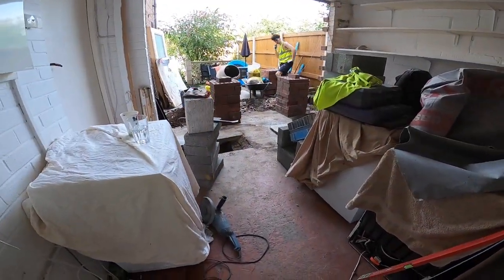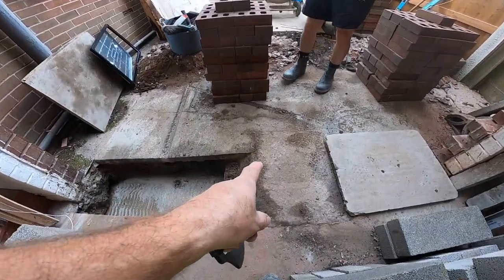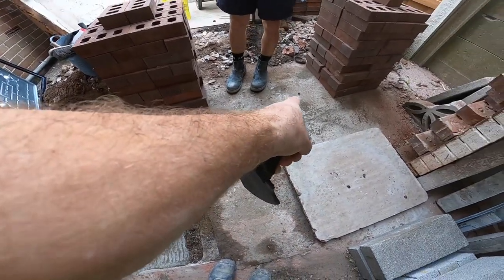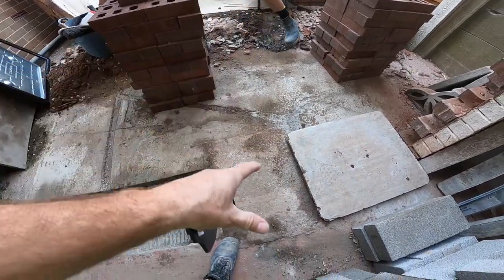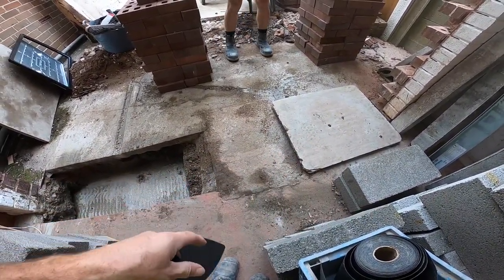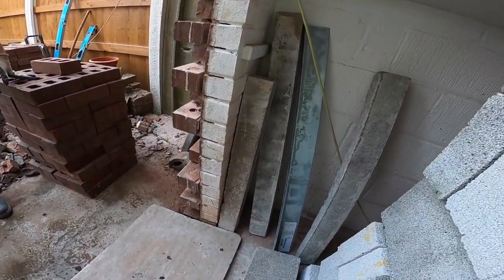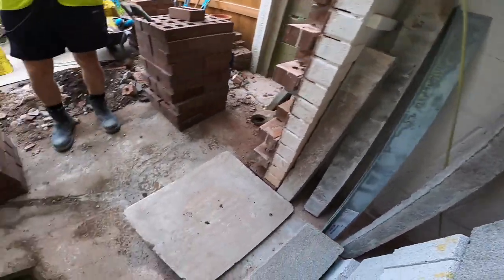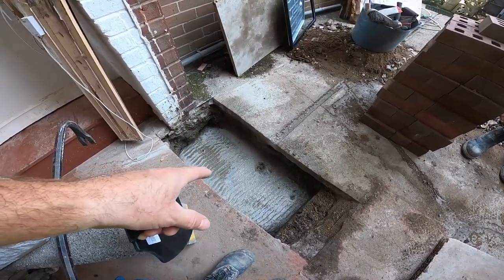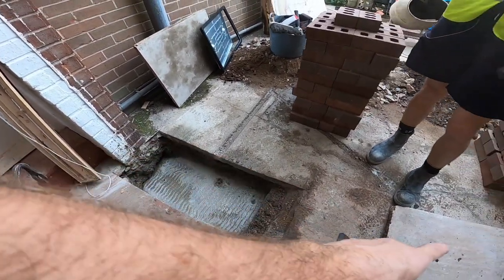There we go, we're all sorted. Grinder's ready for cutting out for the manhole. So we're going to mark out where the wall's going, cut out for the new lid, which is going to go that side of the wall, take the lid out, cut out this side, and bed a flag over the remainder of the manhole to seal it. Then we're going to bed two concrete lintels, one, two, across there. We've gone down nearly 3 foot and put a load of concrete in there, and there's only a door going there. But they know all this, I've told them.